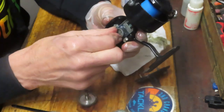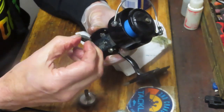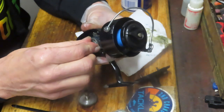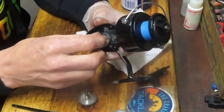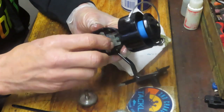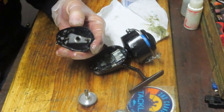It should move the spool all the way up and down. If it gets stuck, just move it one turn and try again — up, all the way down, all the way up, all the way down. If you've rebuilt the reel and can't understand why it's sticking, that rotational misalignment would be the cause.